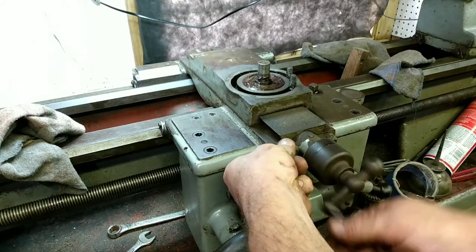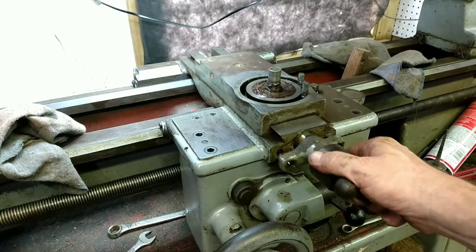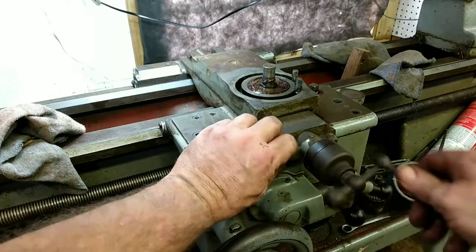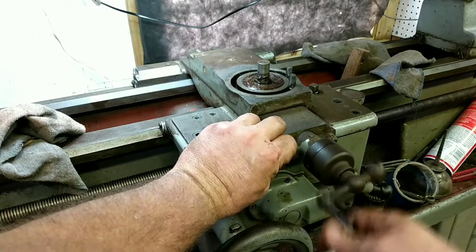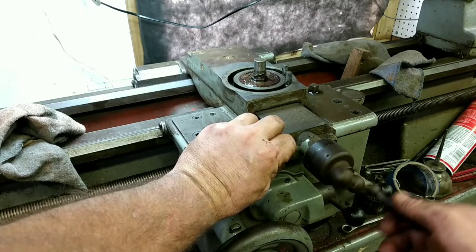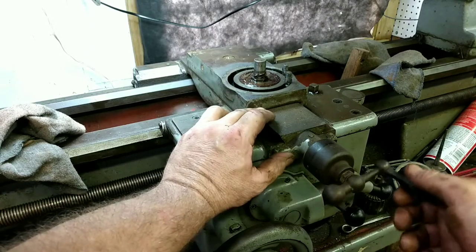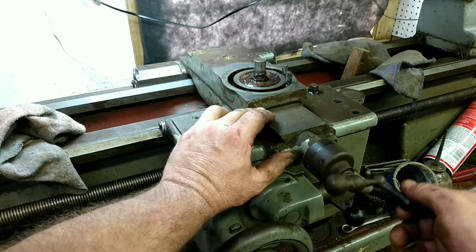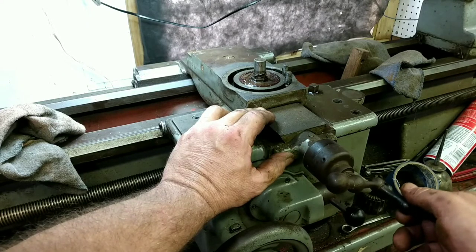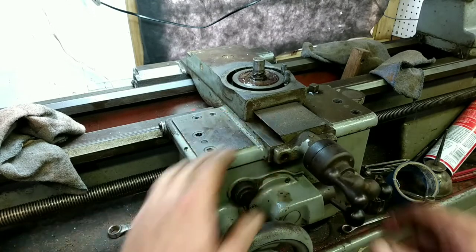So, now I know. Everything looks old and everything. And yeah, I mean, it's smooth as can be. This is the back jaw. Trying to see how much backlash is in it. Pretend this is your maple bench. There is very, very little backlash, about that much right there. Okay, now I'm relieved.